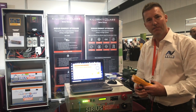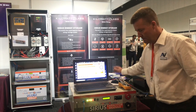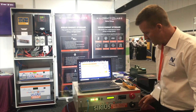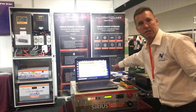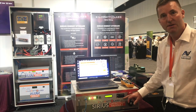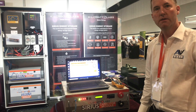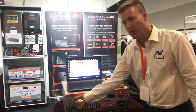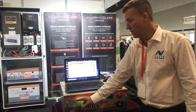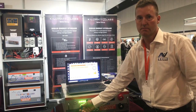Just to run through the key metrics of the unit — has anything changed since the last unit? This module is still 3.55 kilowatt hours. We've added some handles to the front and terminals in the front as well, which means the back's just blind — you can push it into a cabinet. The circuit breaker gives us a lot of safety. In terms of integrating with other equipment, is there any restrictions? No, because this is just for data. There's no BMS or CMS capacity management system required to talk to any inverter, so we can connect this to Victron, Solax, SMA — any brand.